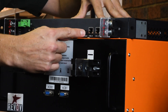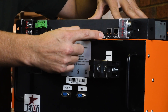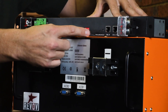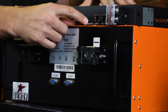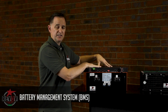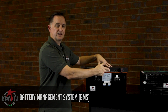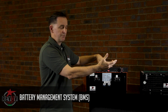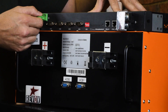There is addressing for daisy chaining and these LED lights: four green, one orange, and one red. The four green LEDs give you the state of charge, each one representing 25%. The yellow is a warning or alert light — you actually want to see it when the battery is at full 100% charge, as it indicates absorption and balancing. The red light indicates any error alarms.